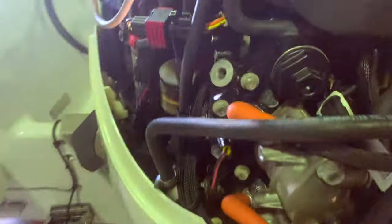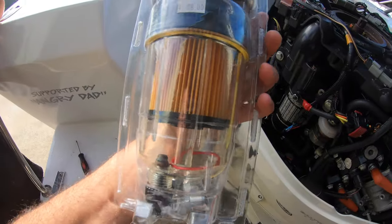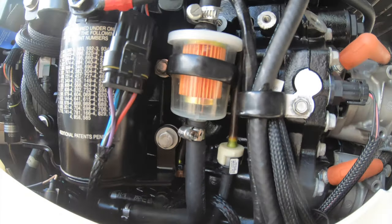Last night we emptied all the fuel out of the fuel tank, and now I've just run the engine to get rid of all the fuel in the system — I don't want any fuel left from the last tank. I took out the fuel water separator, and my cousin works at a marine shop. He told me to buy this one here, which is a full see-through water separating filter kit, so you can see exactly what's going on. We had quite a bit of water getting into the fuel tank somehow — still trying to work that out. But what we're going to do is replace all the filters and put fresh fuel in.